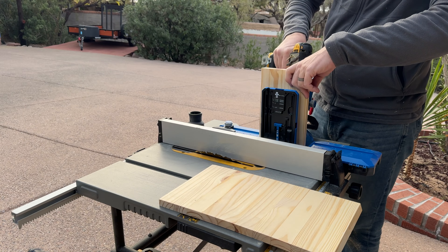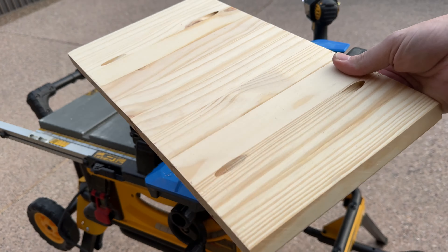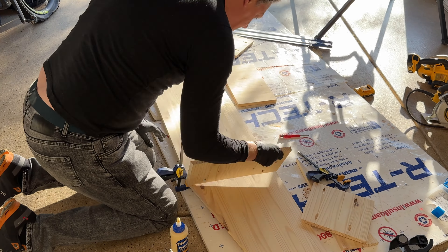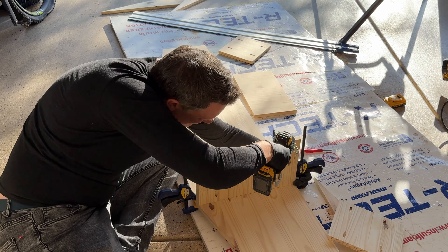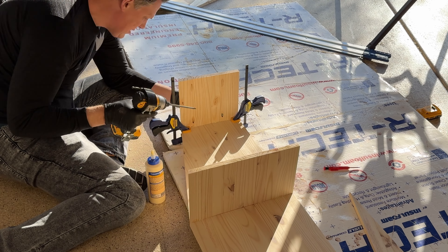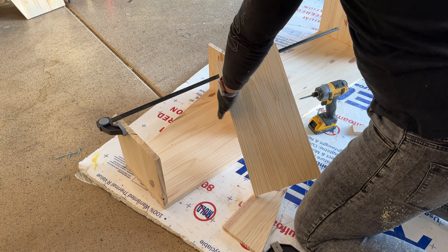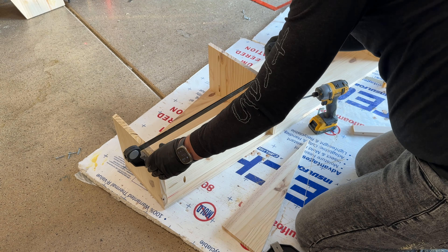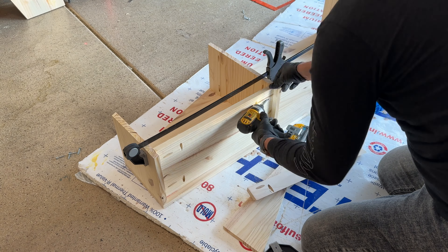I used my pocket hole drill to drill holes on each securing side, making sure everything was nice and square. I used a combination of wood glue and pocket hole screws — I laid down a good bead of wood glue before screwing with pocket hole screws. I also used clamps to make sure everything was perfectly squared up and aligned before screwing, because pocket hole screws tend to slide a little. I constantly checked dimensions and measurements, second-guessing myself even though everything was precisely sized in SketchUp. The boards were slightly off in their measurements, so I checked squareness on everything to make sure it would look level and perfect on the wall.